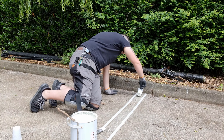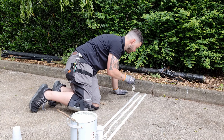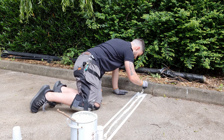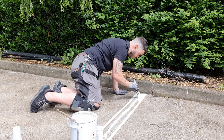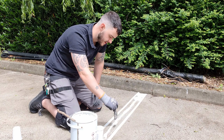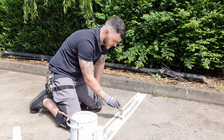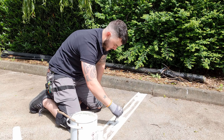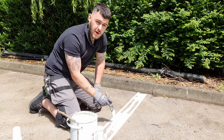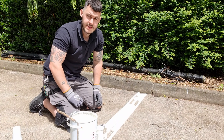Keeping it in the lines, I just run a little line of paint down to start with. Then you start to work it in — I'm going from the edge of the masking tape to the middle, instead of running it to the edge, because all that's going to do is push paint underneath. So grab it from the middle and come from the masking tape inward, then do the other side. If you've got any little holes, just dab your brush into them and give it another brush over. Carry that process on until you've finished your line.